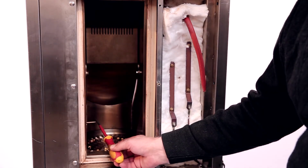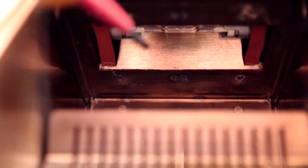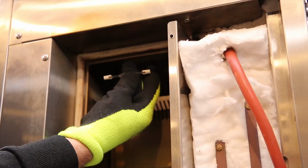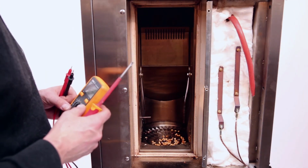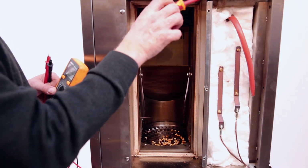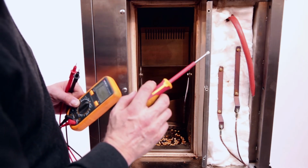The working chamber compartment. The temperature sensor is in the chamber's compartment. To replace the lamp, you need to take off the protective glass and replace the lamp, wearing gloves. For checking the heaters, you will need to dismantle the right hatch, remove the thermal insulation mat. After that, you will get access to the current-carrying bus bars of the heaters.